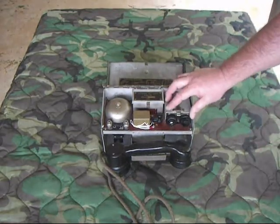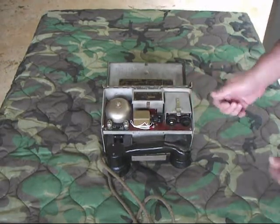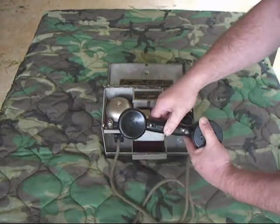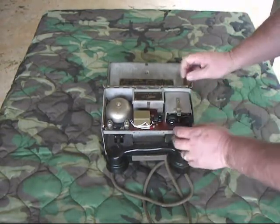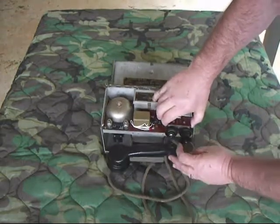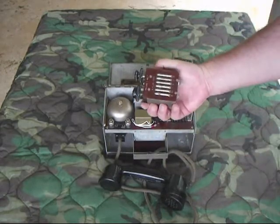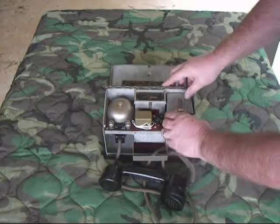It's one of those things that ends a shift or time in the war, and you're constantly having to mess with these and adjust them to get a good clear buzzer tone when you have teletype signals going. The handset, like I said, is right here — it's got a push-to-talk on it. It fits right in there like that. The interesting thing about the buzzer is the whole unit can be removed. Like this. Contacts on the bottom, buzzer piece on top, and it just moves right inside here like this.